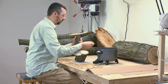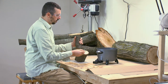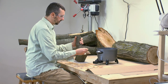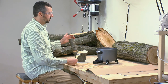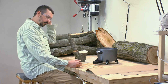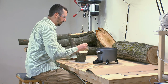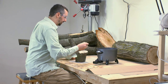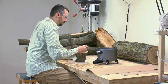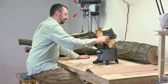Some of those store-bought wood sealers — I just don't see the point. All we're doing is putting a coat on here to prevent water from coming out the ends. This wax is a perfectly fine barrier and it's cheap. Another cost-saving option is to use those heavy-duty tin foil roasting pans from the grocery store — they're three or four dollars and work perfectly fine on the stove. Cook it nice and slow; you don't want to put it on high. We're not trying to boil the wax. I had mine set at 200 and the temperature check read only about 175 — it doesn't take a whole lot.